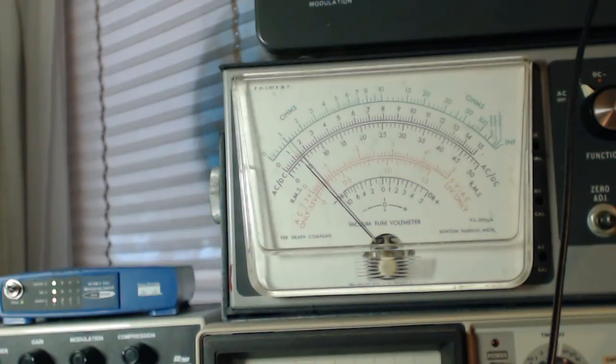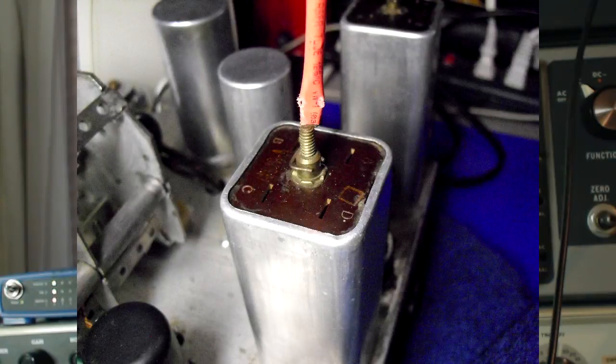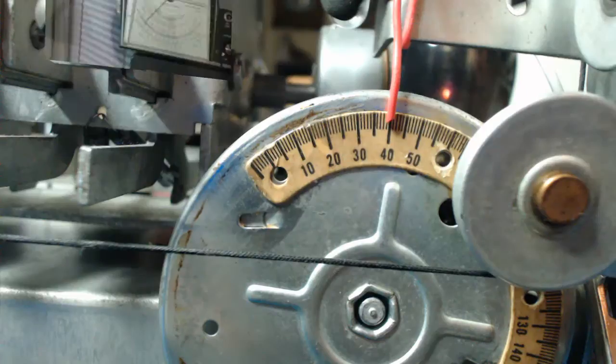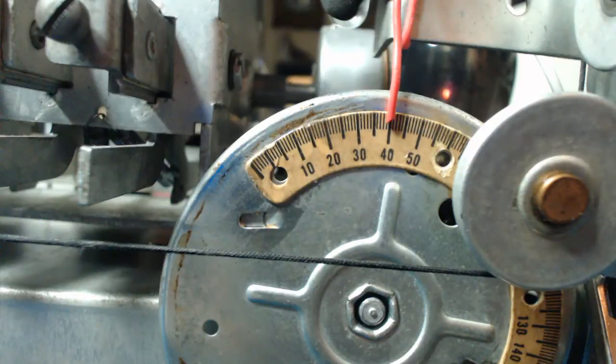Now I'm going to turn the radio over and do the top. We'll keep an eye on the meter. Looks like it wasn't off much, but it was off a little. I'm not done yet. Okay, next we're going to adjust the 1500 kilocycles oscillator adjustment.